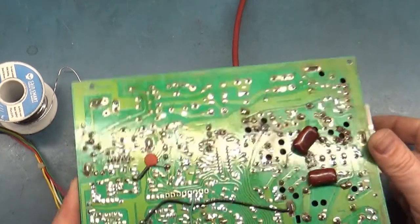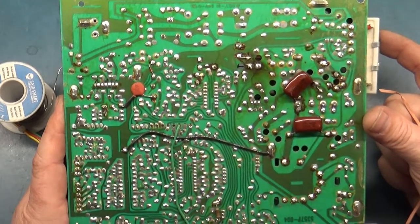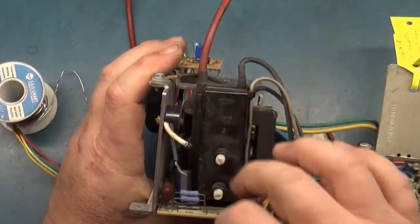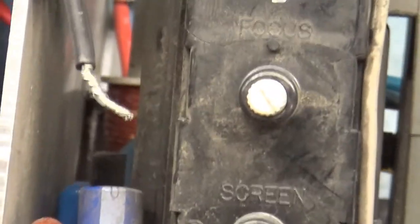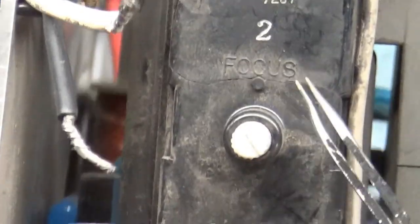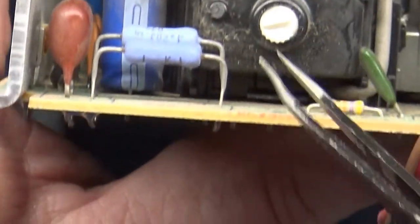Let's take another quick look to see if someone's been doing some reflowing on the flyback. I forgot to mention — the flyback is also nicely cracked. White knob flybacks almost always are all cracked. I'm not going to replace this; we're going to power it up just to see if it works, but I'll probably put a new one on anyway because it's cracked across here, across there, and right across here.